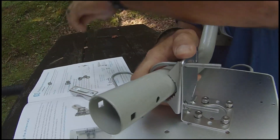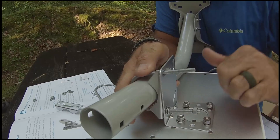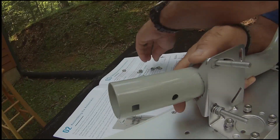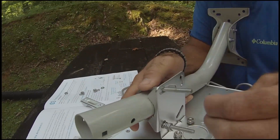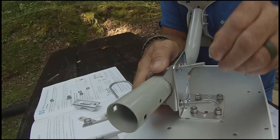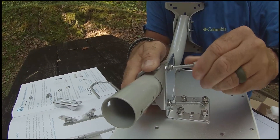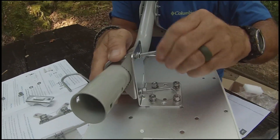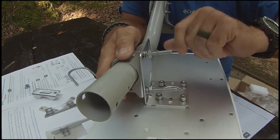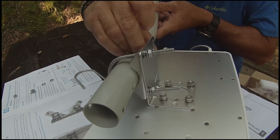At the top of the antenna arm there are two holes — the same two holes are on the other side — and that's what's used to bolt to the base. The antenna arm can be bolted in either direction. The U-bolts wrap around the antenna arm and are threaded through the L-bracket on the back of the antenna, and that's how the antenna fastens to the antenna arm.